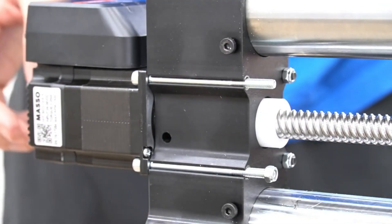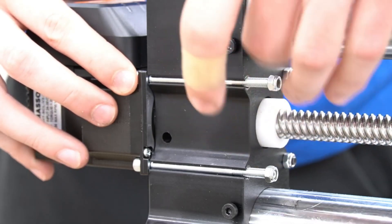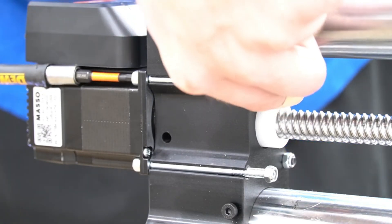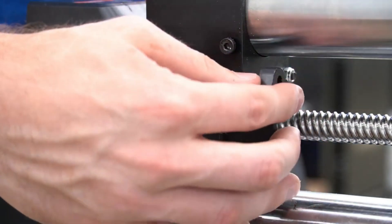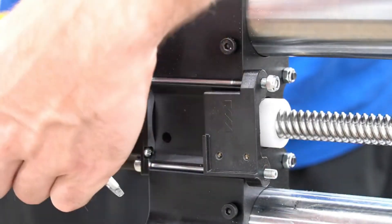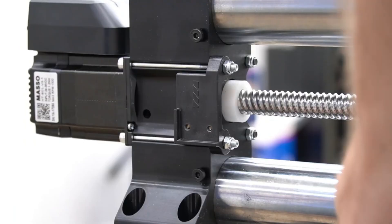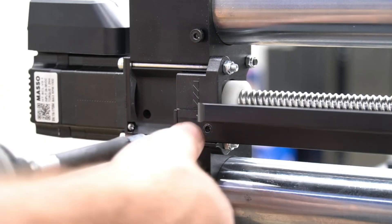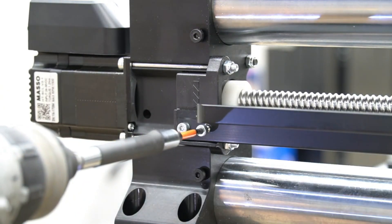It's important not to over-tighten on this side so that we are still able to tighten the bolts and nuts with our brackets for our drag chain raceway. We'll get these hand tight, then come back with our four millimeter hex key and our eight millimeter wrench, again making sure we don't over-tighten, leaving just enough room so they can spin freely and we can tighten the bracket over top. With our first set of nuts in place securing the motor, we'll slide our drag chain bracket over the end of our bolts, then install our second set of nuts, tightening with a four millimeter hex key and an eight millimeter crescent wrench.